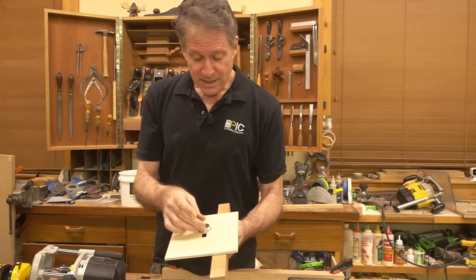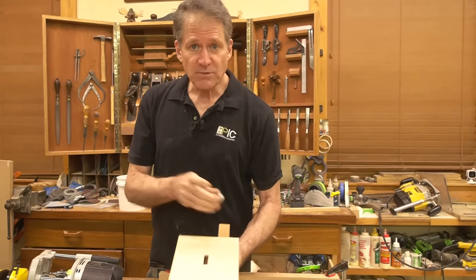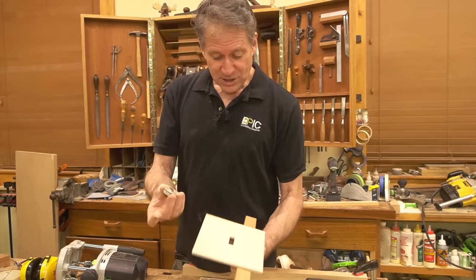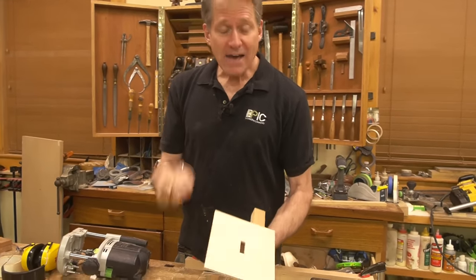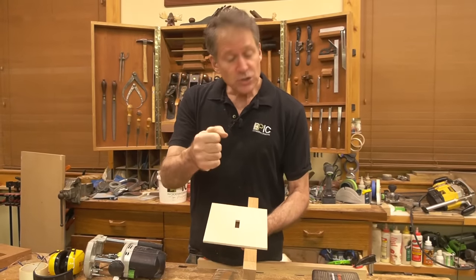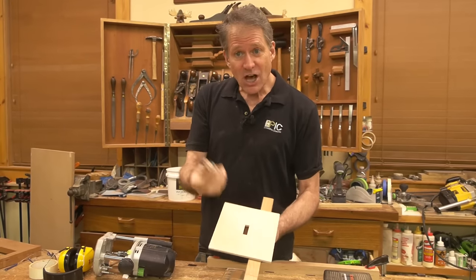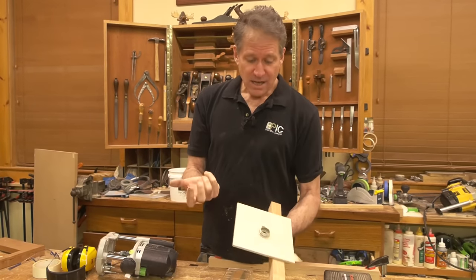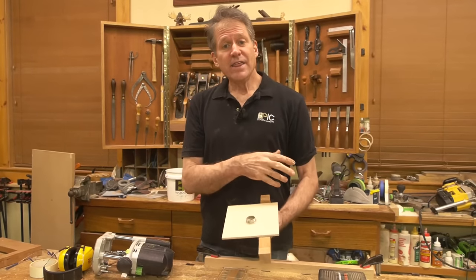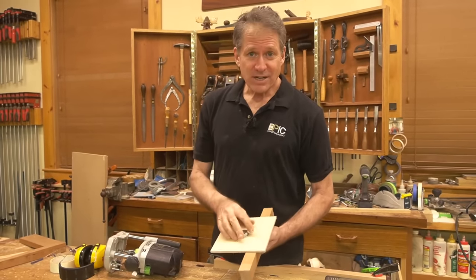You can use just a straight edge, consider the offset, and get a good plunge-route slot. But there's another way to use these collars — make a guide channel similar to something like this. You make a slot, and that guide collar fits so nicely in there that it doesn't even fall out. That guide collar goes in there, then you plunge and slide along your channel. It takes all the mystery out of it — it's not going to slip, and it stops at the end. One issue is getting things clogged with dust — you've got to stop, get the dust out, make sure it's clear, especially before the last cleaning cut.